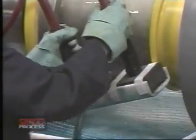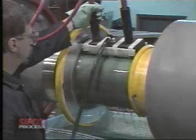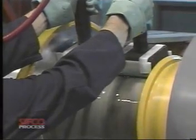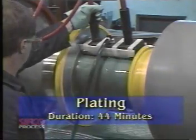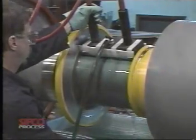When clean, the surface is ready to be plated. An anode conforming to the journal radius will be used. An internal solution manifold will provide a continuous flow of solution to the plating area. After positioning the plating anode, the amperage is increased to our expected value. Plating time for this application will be 44 minutes. We will now monitor the process until completion.